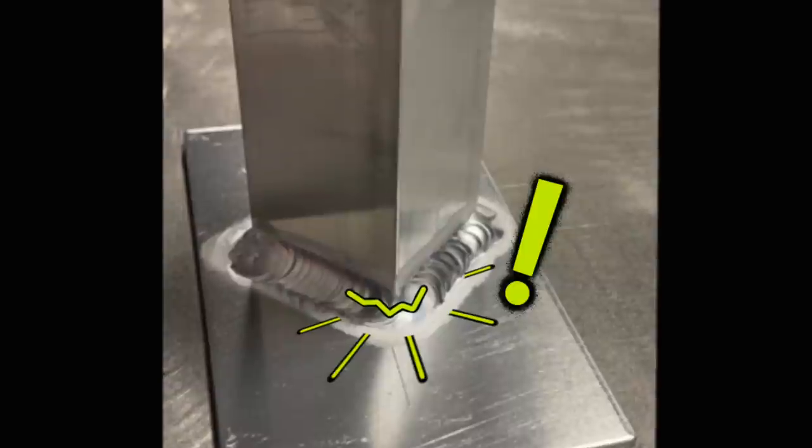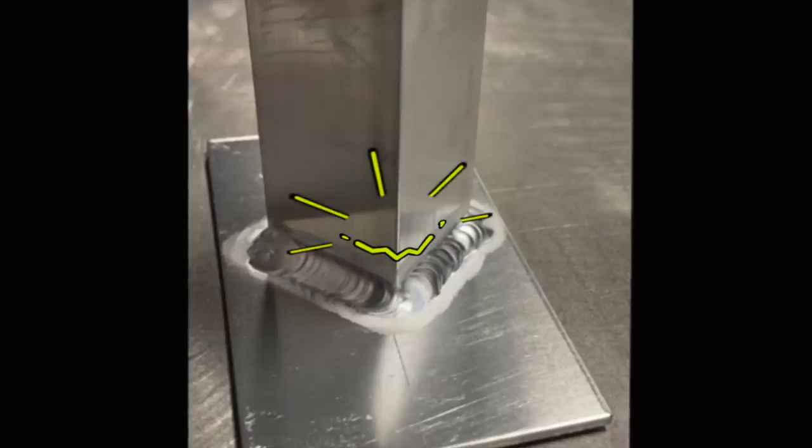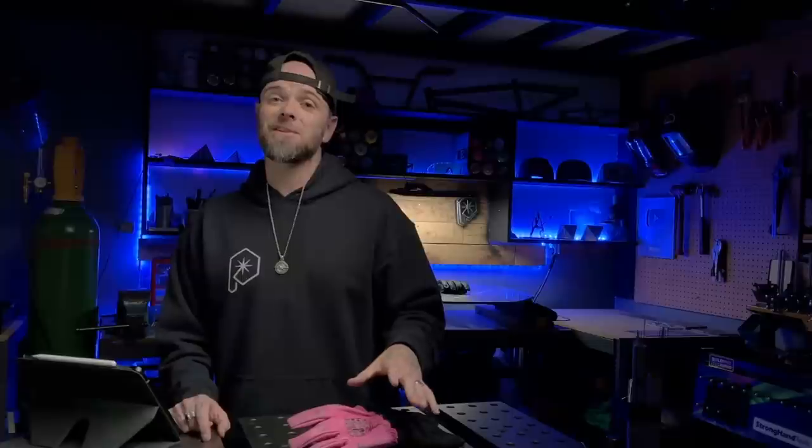This cracking can be caused by a weak corner that has been left open. Commonly, a lot of people think a weld will only fail in the area done improperly, but some of these flaws can actually transfer pressure or distortion into areas you might not even think about — the failure may occur in other areas entirely. If this were mild steel or stainless steel, this could absolutely be a point of corrosion. Even close to the ocean, I've seen certain types of stainless steel start to corrode. If it's not done properly, no metal is safe.